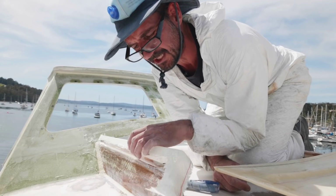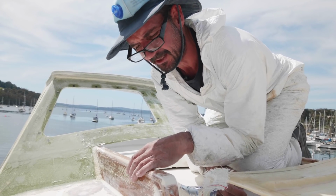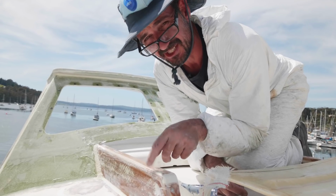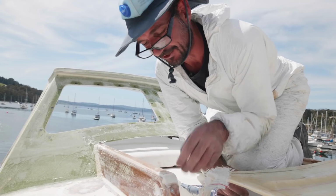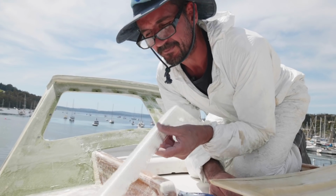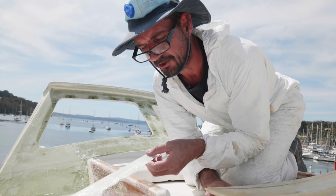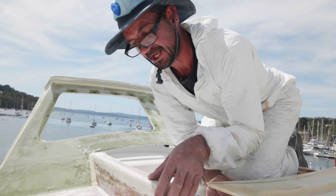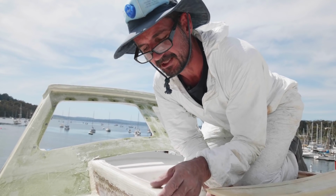If you haven't really considered it before, and we learnt this from our friend David in Cairns building that space age cat of his, this cellophane packaging tape, just like for your boxes and stuff like that, makes just a really great release for epoxy. So whatever shape you want, if you can make it out of foam or whatever you want, wrap it in packaging tape and not have too many wrinkles because it will replicate it, you can make a male mould for just about anything you want out of epoxy really, really quickly and easily.